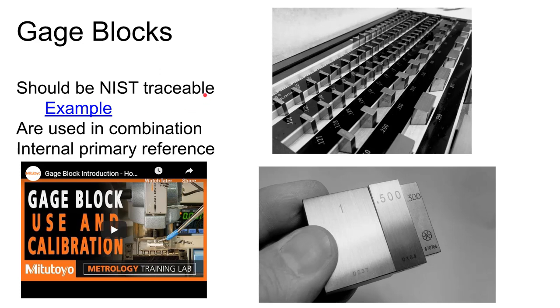NIST is the National Institute of Standards and Technology — they have the last word on what an inch is in the United States. For a fee, they'll evaluate gauge blocks using a laser interferometer, comparing them to their own gauge blocks, which are ultimately defined against the speed of light — specifically the distance light travels over a specific amount of time. The inch is actually derived from the meter, and 25.4 has been an exact conversion factor since the 1950s.